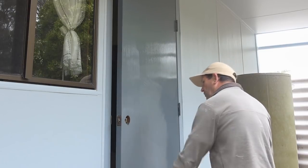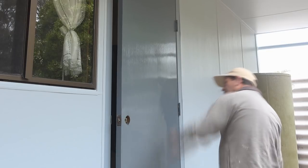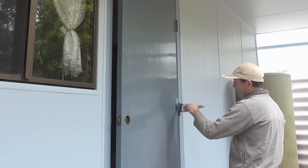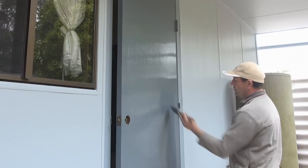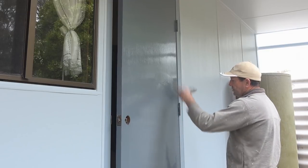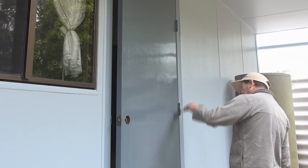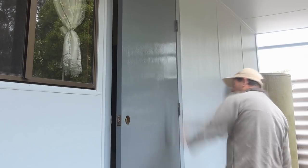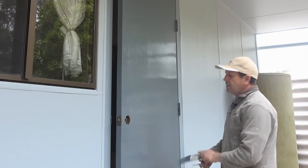Once again I'll lay off and go back into what I've just done. Notice how far I'm brushing back — this way it eliminates any join marks. I'll cut this edge in first, then apply the paint, making sure to brush it out fairly evenly. I'll lay it off again, going quite a way into the existing paint. That's the reason why you want to do it quickly, so the paint stays wet.